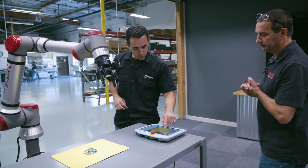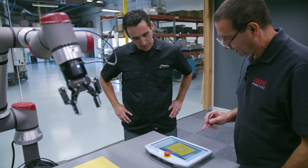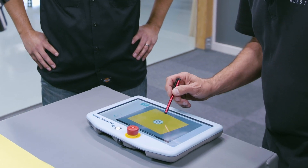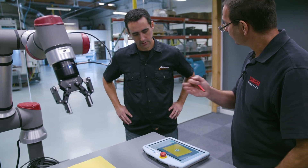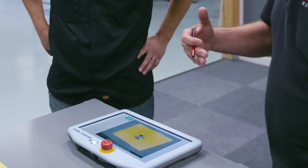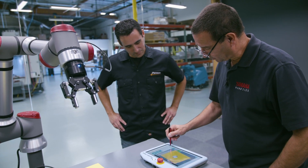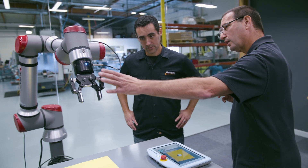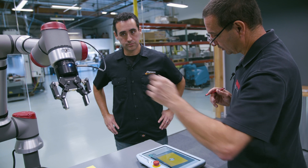I see on this display it has green lines and red lines — what are those? The green lines are the features it's looking at. It says 'I see the outer circumference and I see all the circumferences of each of those six, seven, eight, nine, ten holes, for example.' And you can remove those as needed — you can say 'I only care about the outside; maybe the inside changes but it's still the same part.' The red lines are giving you orientation. So we saw that it says we're good and we're going to set a model now, because the camera doesn't know what kind of gripper or end effector is on there — now we have to teach the camera what is on here.